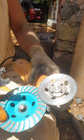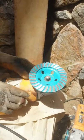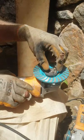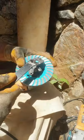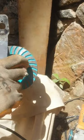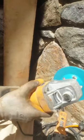The diamond grinding blade is finished. That was looking rough before and it looks much better after. I cannot even remove it — it's very difficult, I need another grinder to cut it off, it's blocked. It has to fit — you have to choose the right size; this is a four-and-a-half inch size. I remove the mask to talk to you. Now I'm fixing a coated steel grinding blade. I push on the locking button and use my key to tighten it up. It's tight enough and we can start to work with it.